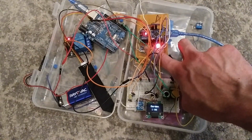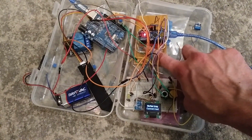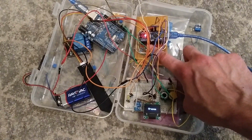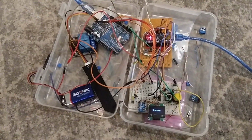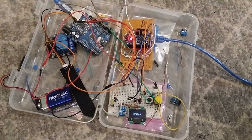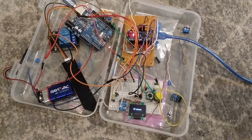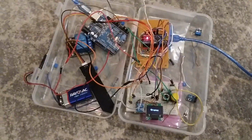And pressing the menu button during any one of the watering intervals will cancel. Pressing the select button during the 15-minute and 30-minute watering intervals advances to a higher time interval, but when it's at 1 hour, that also cancels it, so I'll show that with the grapes here.